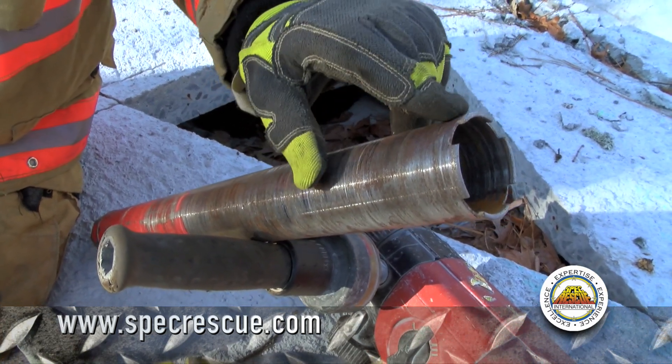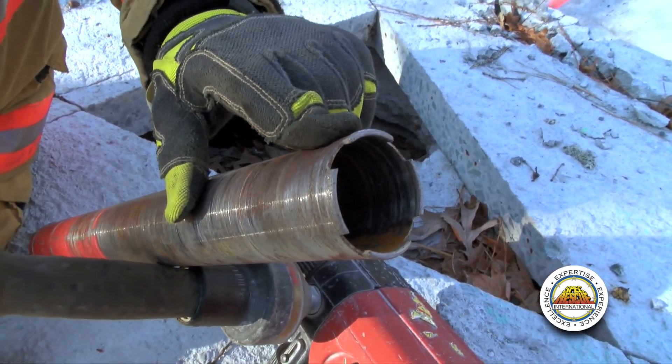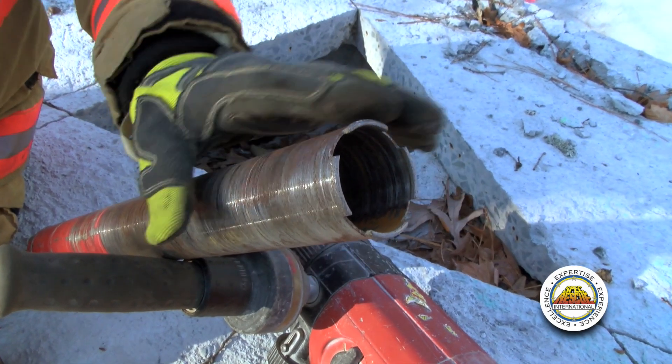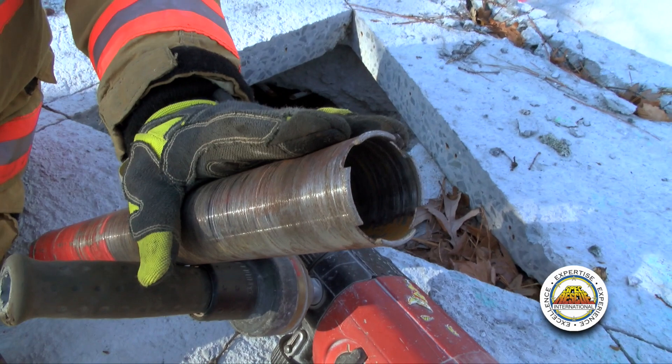What's very important to note about this diamond cutting matrix is it has to be lubricated with water — both internally fed and on the outside. You have to have a water source to be able to use this type of bit when you're doing coring.